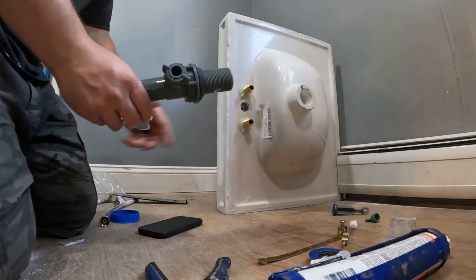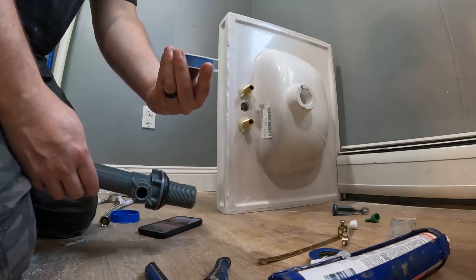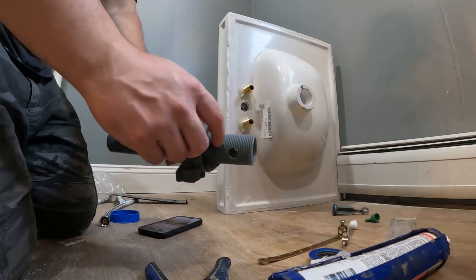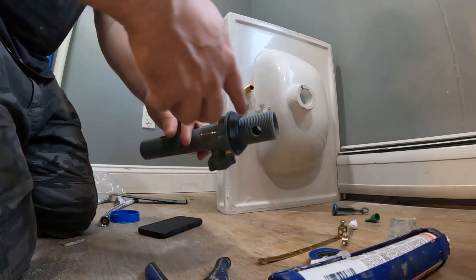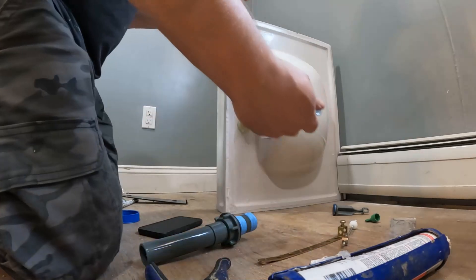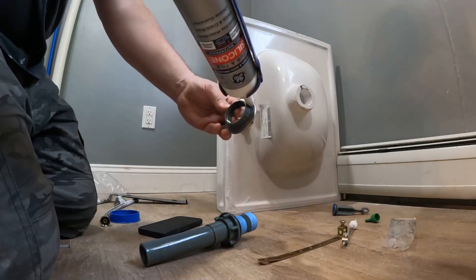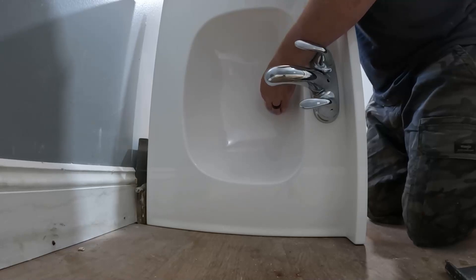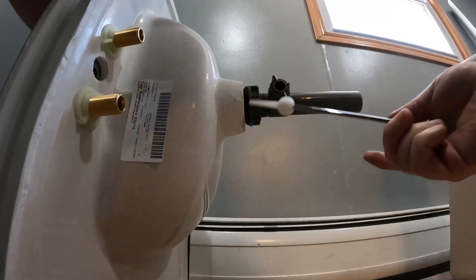So we're putting the sink together. I already screwed on the faucet and now it's time for the drain tailpiece. I always take some Blue Monster thread tape and tape up these threads on here. Sometimes water can get in these threads and seep through around this rubber gasket — sometimes it doesn't, but sometimes it does, so I always tape this up. You don't have to do a ton, that's fine. And then for this guy, I'm going to put caulk around it. This goes on the top, then she's going to screw right onto there. Just make sure this guy is pointing out the back because you're going to put this drain thing on there.